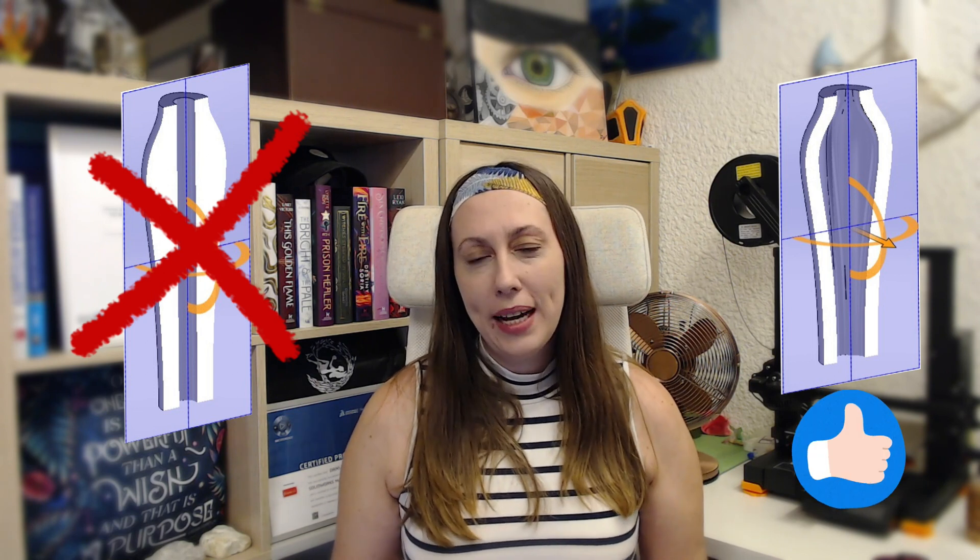Next tip is shape. When I was designing this seed, I needed an outer shape and a hole inside in which I would put a PMMA string. Usually what you would do is design the outer shape, put a hole inside, and send it for printing — and that's wrong. If you want to print correctly, you should just shell the shape and calculate it so the hole inside corresponds to what you need. You don't need a circular hole to fulfill your needs.